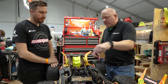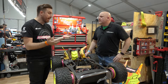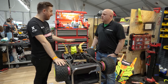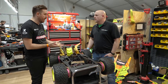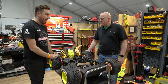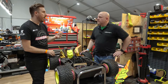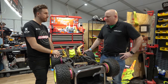Something I hadn't thought about is how many of these components you're repeating the use of. In my mind I would have thought your drive motors and your weapon motors would have been different. And in a lot of ways you want different things out of them — for example, our drivetrain runs about 25 miles an hour, but the weapon at the tips of the teeth spins at 200 miles an hour. So we have totally different gearing and a very different load on the motors, but fortunately with this motor and controller combo we found something that is good at both jobs. It makes it a lot easier for swapping out parts and taking spares, and it was an important progression off of previous years where we didn't do that.